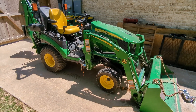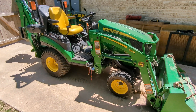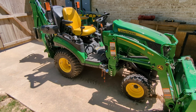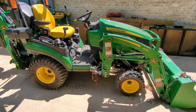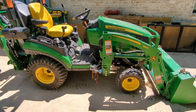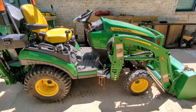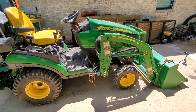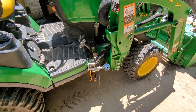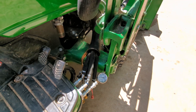To get started here, we'll start with a pressure test. I've got this one pretty close to stock actually. The tractor's already warmed up. I think I've got it at 1900 PSI, but we'll see what it's exactly at. The 1900 PSI is what I think both of my tractors were stock, and from reading things online it seems to be a pretty common factory setting. The spec is 2000 plus or minus 150 on the latest service manual. First thing we'll do is check this pressure — the tractor's already warmed up.